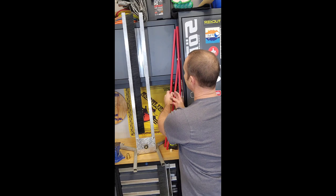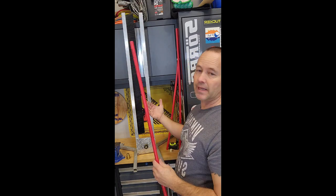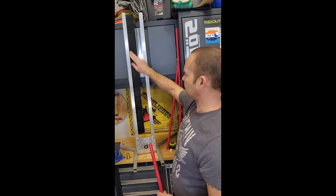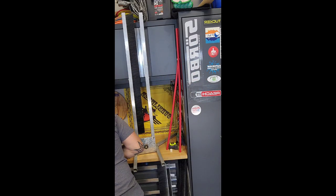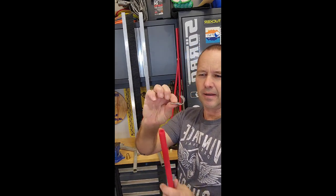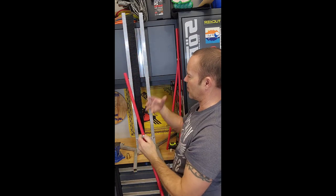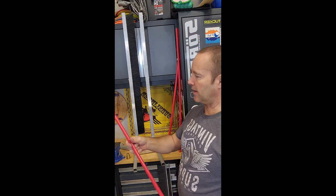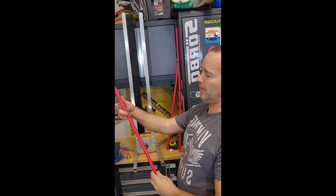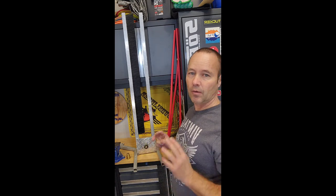It's performed well for three years. The only reason I tore it apart now is because I originally had my upright fittings for the water supply siliconed to the side. Now I have three different crimp pieces that attach right here, connect into here, and mount to the inside wall so they don't move. After three years, the silicone just wasn't adhesive enough — the heat probably made the half-inch flex tube pop away. It's better now because I replaced the main connections and it's much simpler.